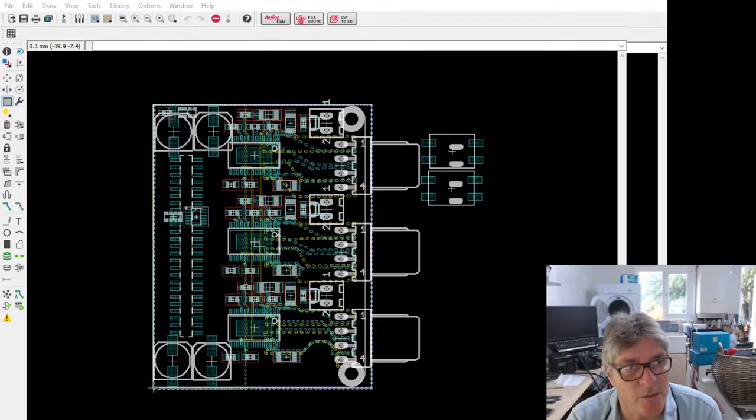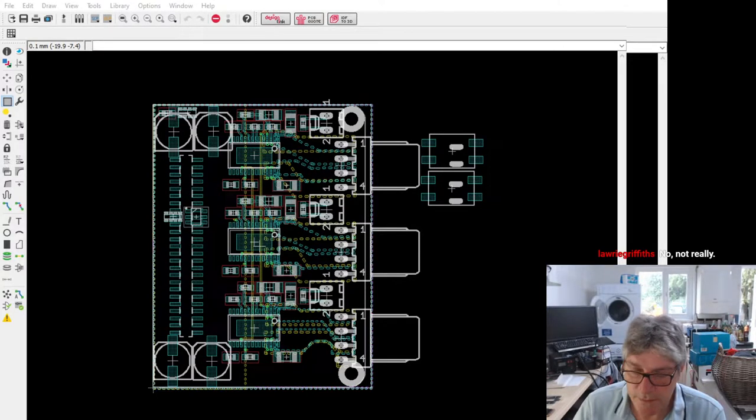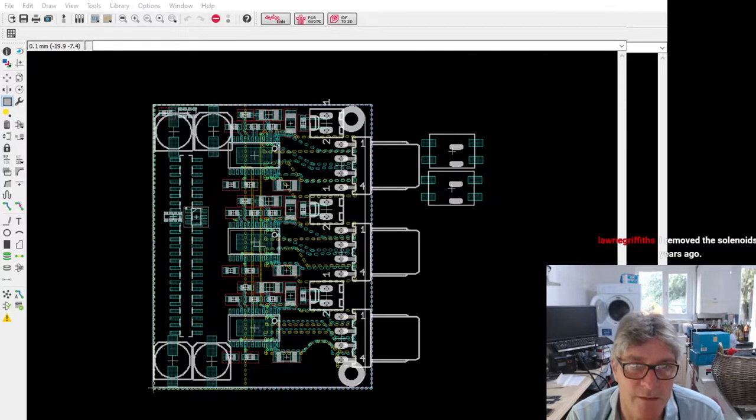But yeah, if you're talking about regulating the water, normally you have a solenoid. And that solenoid, I think, is normally closed, so you only got power when you've got the water on. Can you remember what the current requirements were for that, Laurie? Yeah, depends what the current is. But at a higher voltage, you need less current normally, which is why it's good to use something like 20 or 24 volts if you can. Go as high as you can really on the voltage side. That means you need to put less current in order to get the same power out.